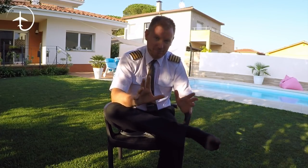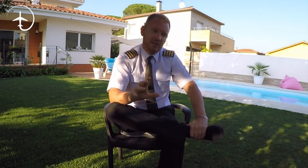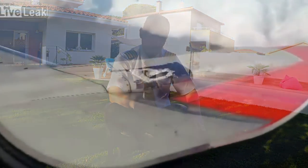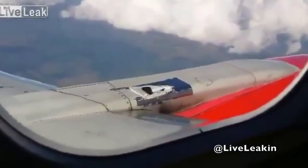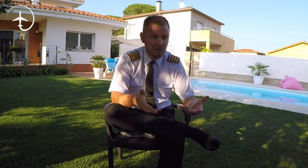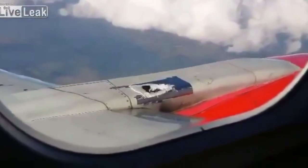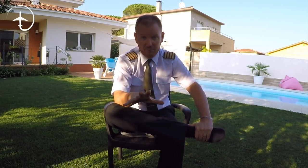I do understand why people get afraid when they see this. Another thing to remember is that if you are actually seeing one of those fixes fail — let's say you're flying and all of a sudden that speed tape starts to loosen and flap around on the wing — it is not dangerous. This would have been applied only on a non-load-bearing part of the aircraft. Even though it looks very bad while it's flapping around and maybe showing a gaping hole, it is not actually dangerous. In fact, in most cases the part you're seeing could actually be removed and it would come with a performance penalty, maybe a fuel penalty, but that would probably be it.